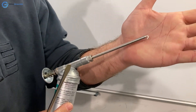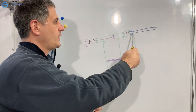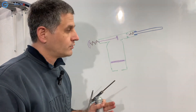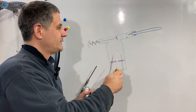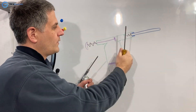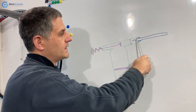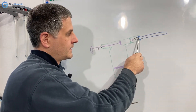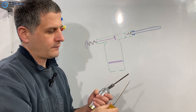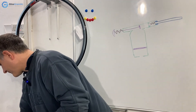You can see it's still moving out. I don't like this. Why did they make it this way? I don't know — maybe they wanted to prevent this from creating a vacuum and sucking grease back in, which would then take longer to push out because the nozzle is long. However, this is a very small opening, and the nozzle end is also a very small diameter. When I create a vacuum, air will most easily come through the wide opening in the bottom and push the seal — I don't think this is something to worry about. So I hope that when I unscrew this and remove the spring and the ball, it will work okay without problems and without that oozing effect. Maybe it won't work very well at all — I will see. I cannot know for sure, but that's what I'll try to do here. Let's go.